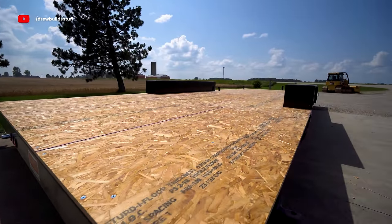With all the walls in place and braced, I'm taking out these temporary screws, and then I'm drilling through a half-inch hole, and then using these half-inch stainless steel bolts and washers, and then this nylon lock nut to bolt these walls down. I'd sink the bolts as tight as I could with the impact, and then give them one last burst of some man energy.